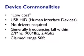These are mostly using unlicensed bands, 27 megahertz, 900 megahertz. I've seen some at 49, 2.4 gigahertz. And even though it's 2.4 gigahertz, don't assume that that's going to be Bluetooth or Wi-Fi. It's still spread spectrum, but you can still access the chips and be able to read data off of them. There's no encryption and there's no authentication.